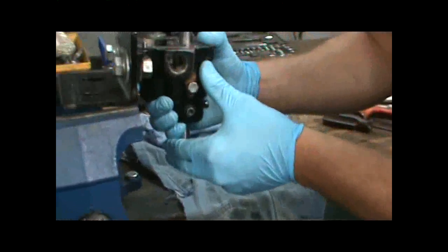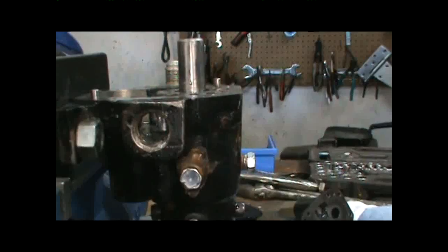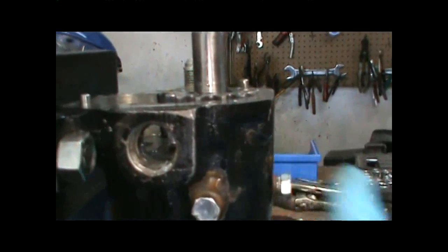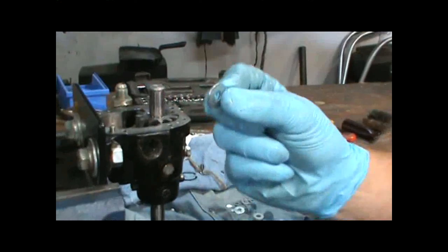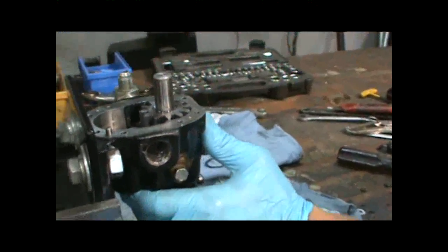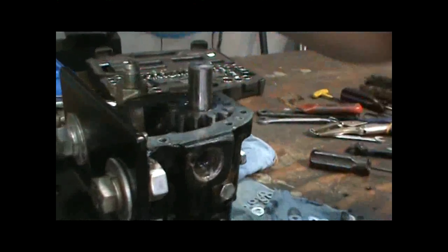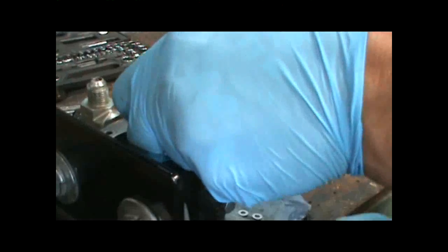Our next step is to remove the second gear off the main shaft itself — clamping the pump into the vise makes it much easier. Using a dead blow hammer or plastic hammer, tap on the main shaft down, and then come from the other side and tap it up. As you can see, I created a gap on the gear from the housing. Using a small shim or washer, place it underneath the gear in between the gear and the housing. Repeat the process, tapping the shaft down and then back up, continuing to add washers. I used about 10 washers to remove this gear off the shaft.